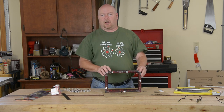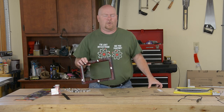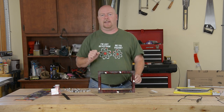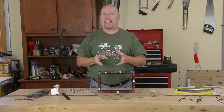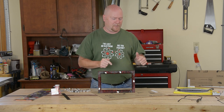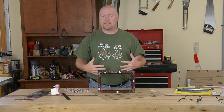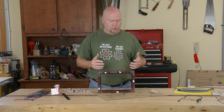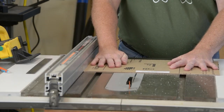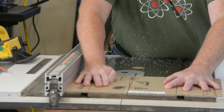Here's where I'm going to jump the shark with this project. Everybody else's frame I've seen has a solid wooden back — we're going to do acrylic. I've put the 200-tooth blade in the table saw. If you don't have a high tooth count blade, you can score and snap this stuff, or just go ahead and get a piece of glass cut to size. If there's a trick to making good acrylic cuts on the table saw, it's to push the material through the blade fast — but make sure you're lined up so it's only the acrylic going through the blade.